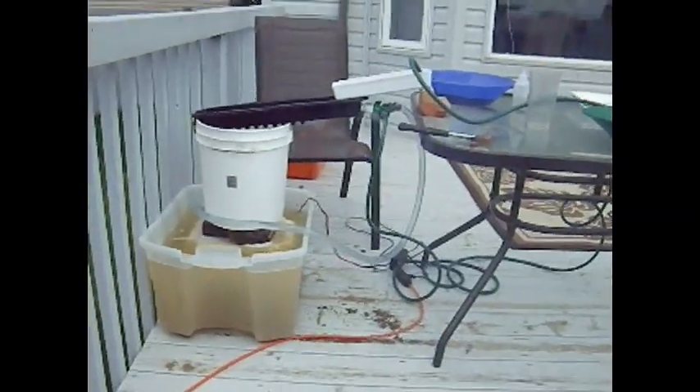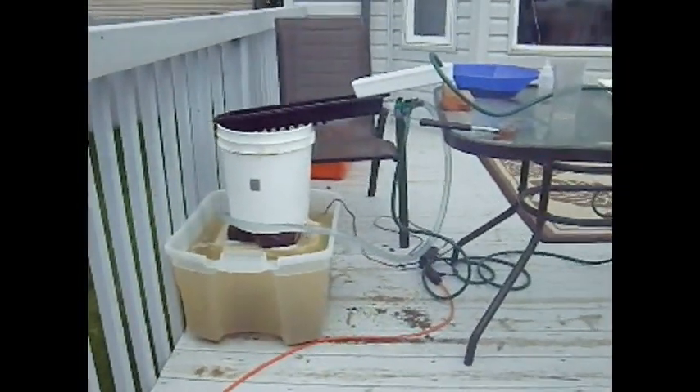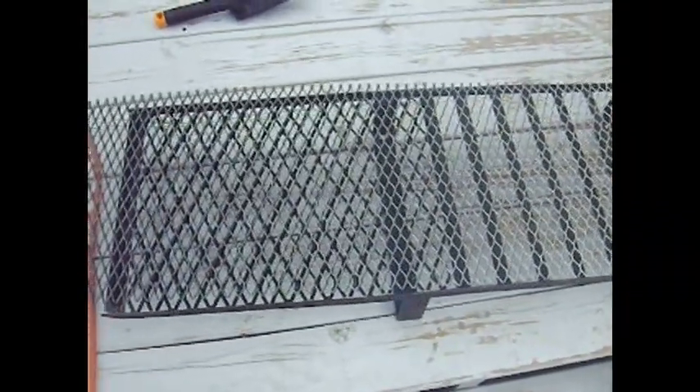While I wait for the last of that to clean out, I'm going to do one more test where I'm going to insert some half-inch expanded metal underneath my existing riffle and expanded metal tray. So there's three-quarter inch there, there's Hungarians there, and then under this I'll be putting the half-inch expanded, and that'll go on top of both hog mats and miner's moss.